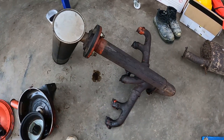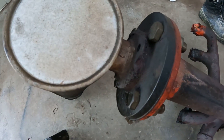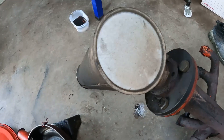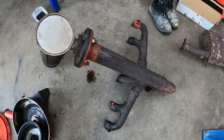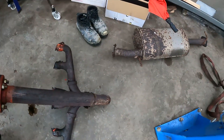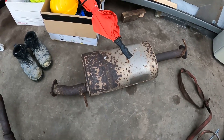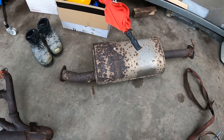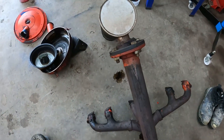I just went to lift this exhaust — it's freakishly heavy. Someone cobbled a one and a half inch muffler onto this three inch pipe for this six liter engine. I think we're going to cut that off and find a nice two and a half inch Land Rover muffler from the back of the scrap pile, which is definitely going to be better. We'll weld it on — it'll be grand. Better than this mess anyway.